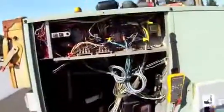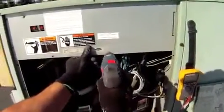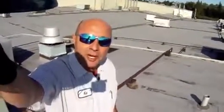I can replace my electrical connections on the capacitor, replace the boot connector, and make sure that's on there nice and securely. Then I'll close up the unit, close up the electrical, and turn this unit back on. We'll be ready to cool that conference room and keep all those people in the meeting downstairs nice and cool on this warm summer day. I've completed my check using my 116 meter. I know my capacitor is good. I'm going to re-energize the system, and in a few seconds that fan motor is going to come back on and people down in the conference area will be nice and cool. My name is Ken Packwood. Glad you were able to join us today, and I'll see you next time.